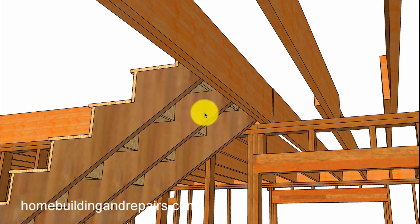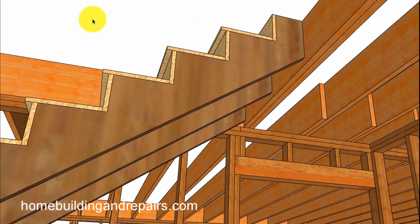This video was inspired by someone who sent me an email saying that their architect said the stairway wouldn't work. Sometimes a simple explanation can provide you with a reason why, and a lot of that might have to do with the floor framing more than the stairway itself. Here we can see that the stringers are butting up against the doubler and being supported.